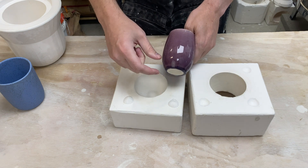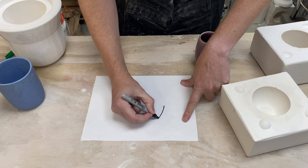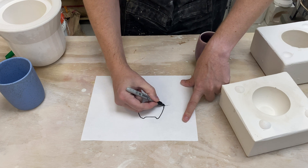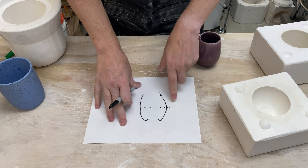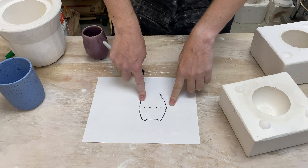So what we've done basically is created two one-part molds and stacked them on top of each other, so our design can accommodate the draft angles on each half. If we were to sketch this out, we have our bottom profile — say we have a foot and draw the whole thing around. Then there's this magic line in the middle where it's the widest, and from there we have a draft angle the other way. That's not symmetric, but that's why I draw things in the computer. So any design like this we should be able to do in two pieces. Can we just make two one-part molds and stack them together? I think the answer is yes. It will require some more work when we're in clay, but we should be able to create more complicated shapes by doing that. Let's go ahead and try it out.